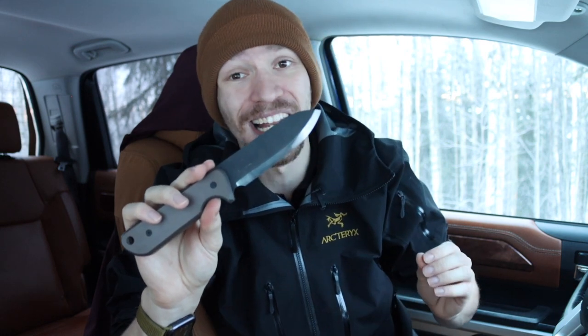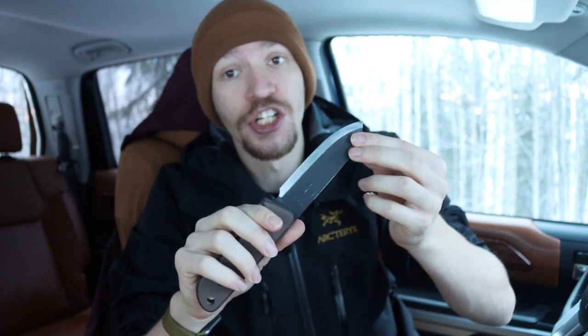The reason I said it was a bad knife is that the ergonomics weren't very hand-filling or comfortable. Having a top guard on the handle made it difficult to choke up and do fine, skilled tasks like a knife should allow. When you look at it from the perspective of a sharpened pry bar, it's not a half-bad tool. But on the knife side of things, I don't think 420HC is a particularly good knife steel — it does not hold a keen edge as long as O1 tool steel, 1095 high carbon, SK5 high carbon, and other steels I've compared in previous videos.